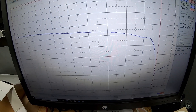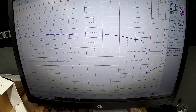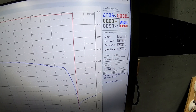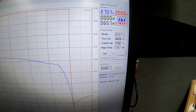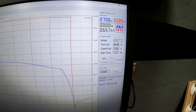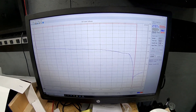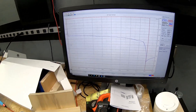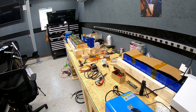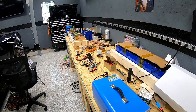Just to wrap it up: this is the same cell we did the charge test on yesterday. We were able to get 278 and a half amp hours out of this cell with a 40 amp constant current discharge and a cutoff voltage of 2.5 volts, with the test taking six hours and 57 minutes. I'm going to start this battery back on the charge cycle so it doesn't sit in a discharged state. We'll bring you back when we get the cells into the pressure setup and I'll show you the materials we're going to use.